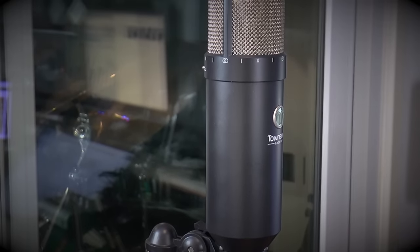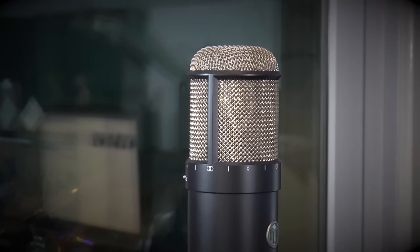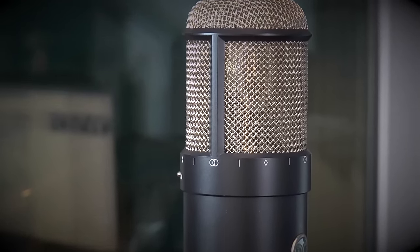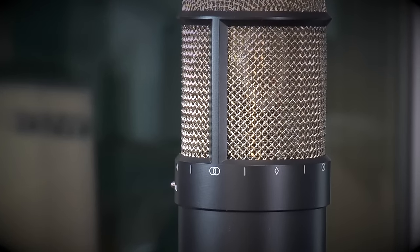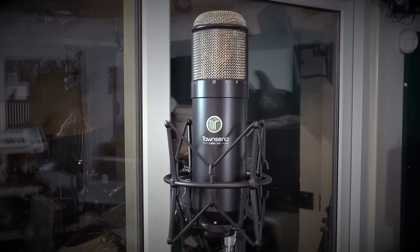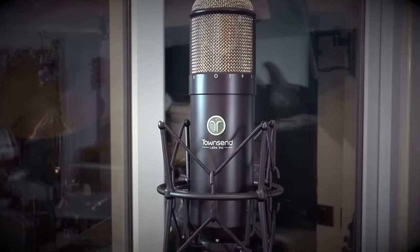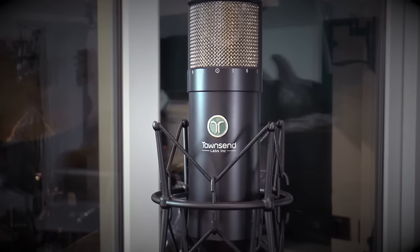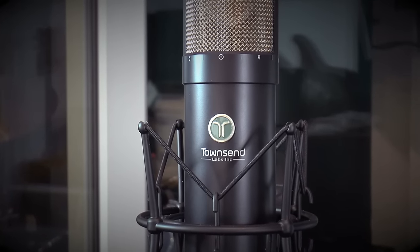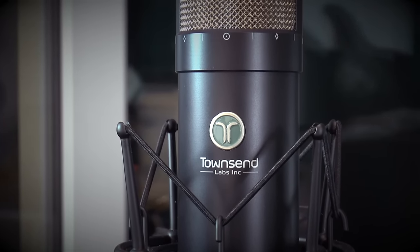So you might be asking yourself why this microphone has two outputs. Well, a key aspect of the sound of any microphone is how it picks up the sound from different directions. Its polar pattern, if you will. Now the guys at Townsend Labs say that having two channels allows the Sphere microphone to reconstruct this directional response of other microphones. In layman's terms, the microphone models are three-dimensional, whereas other microphone modelling systems are one-dimensional. And by one-dimensional, no boy band references please, I mean that other mic modelling products can at best only model the on-axis response of a microphone at only one given distance. With two diaphragms, the Sphere system is much more realistic and much more true to the original.